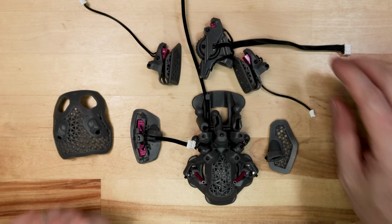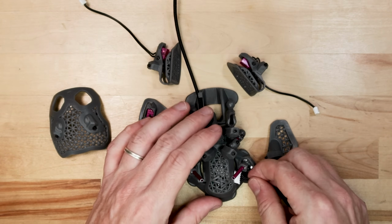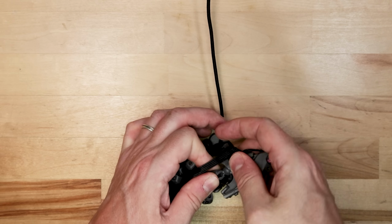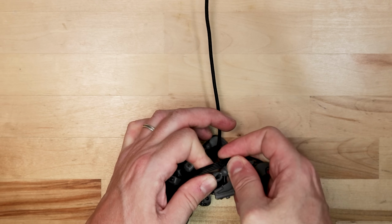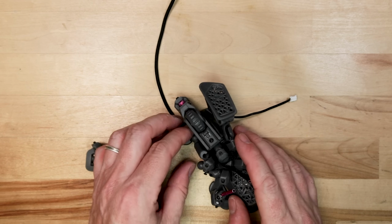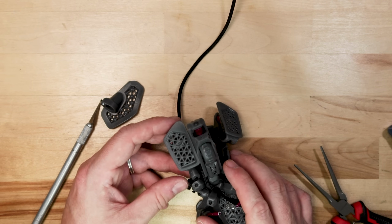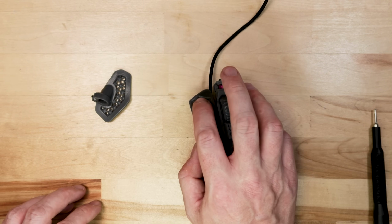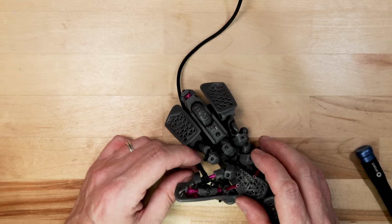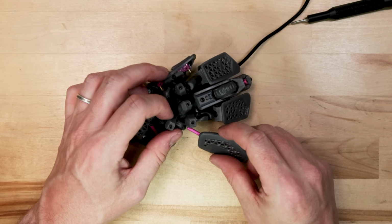Now that I have all my subcomponents assembled, it's time for the final surface assembly onto the core of the Statial B. The order of the steps from here on out doesn't really matter. I usually start with the front, left, right, and middle mouse button assemblies and move back from there. You're just basically popping these on to their matching ball sockets. Sometimes these sockets can be pretty sticky and may require a gentle use of pliers to get them in place.